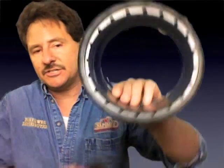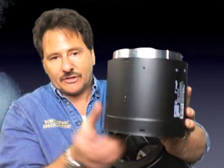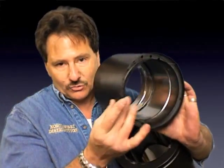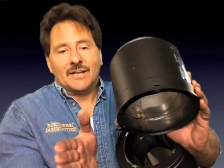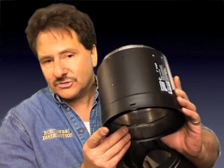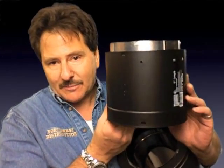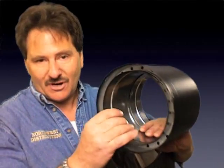Here we have a piece of DVL pipe — this is close-clearance interior pipe. DVL can be six inches to combustibles, so that's why they use a double wall pipe with air cooling inside; it gives you the ability to get closer to combustible materials. If you want to have that chimney pipe backed into a corner or close against the wall, you're going to need some of this pipe. It's also required in any mobile home installation. Regular single wall pipe is 18 inches to combustibles.